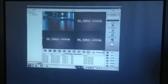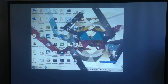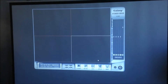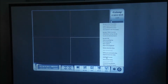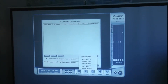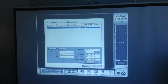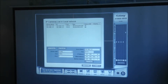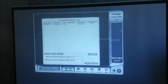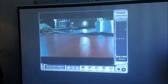We have software that is compatible with most of the cameras. Let's go look for the camera — I will launch the Hybrid DVR. Then I click on the menu, go to Add/Delete IP Camera, then IP Search, then DX Series IP Search. It takes a little while to find the camera. I found one of the cameras. I enter the password, click Add to DVR, then Exit, then Connect, click OK, then Save. And here you go — you've got the camera working.